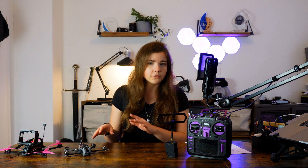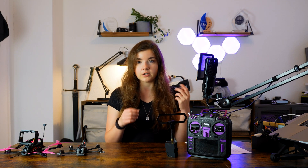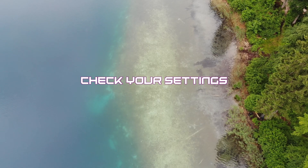Antenna state: we all crash, stuff happens, we lose parts, and sometimes those Crossfire antennas don't look as they should. If you want to do serious long range, be sure your antenna's condition is splendid. It may be that your antenna is broken in the least fortunate place — like next to the UFL connector or somewhere covered with tape. Be sure to always check your antenna state, and if you're losing RX really fast, come back as soon as possible because something may be wrong with your antenna.